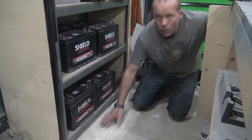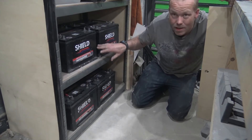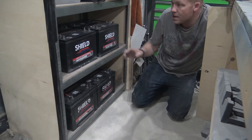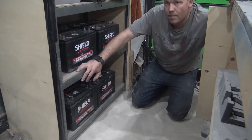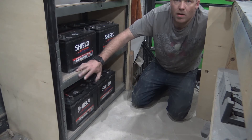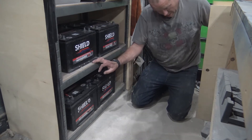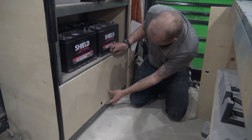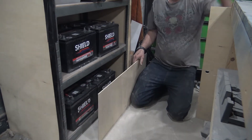We're down on the floor with the battery bank that I made up as discussed. These are wired in series and then in parallel. The cables for the positive side, which is this end, go down the back — same with the negative side on that end. I've put this plywood here on both ends to stop anything like bits of metal flying in there while I'm working, which could cause a spark or fire hazard. I need to put some boards on the front as well. I've cut these boards and I'm going to put them on using duct tape as a cloth hinge.